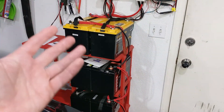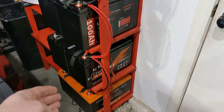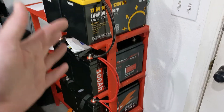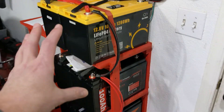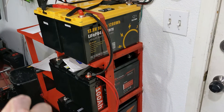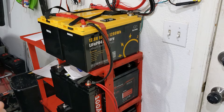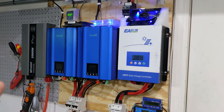I really like them — I like the data, that's why I keep them on top. These batteries are 10 kilowatt hours in total. And because I don't want to run them at full power all the time, I'm only pulling about eight kilowatt hours out of them. So throughout the day they charge and discharge about eight kilowatt hours, and everything else comes through the inverters from my solar panels directly.